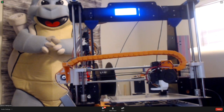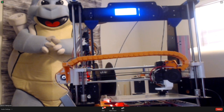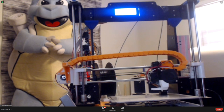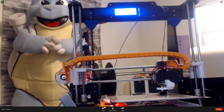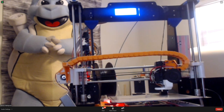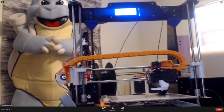For fusing it after, I use a resin epoxy. I just go get it at Home Depot or Walmart or anywhere that sells construction grade adhesives. And then I use an old soldering iron and old rolls of PLA to kind of solder the two halves together, just to really make sure it has a strong bond. That's how I put most of my parts together.